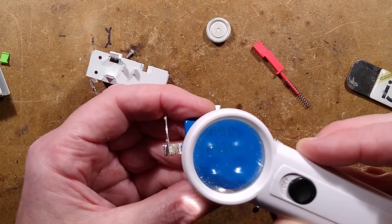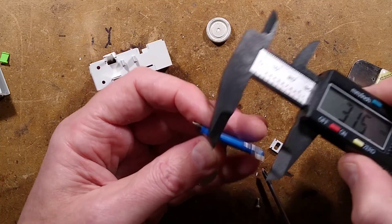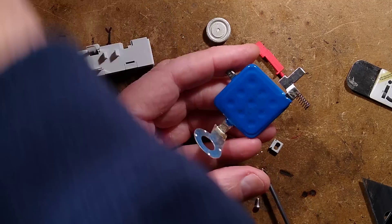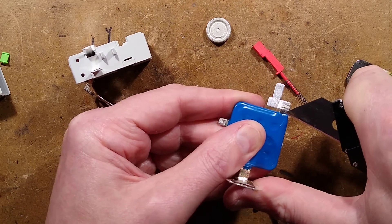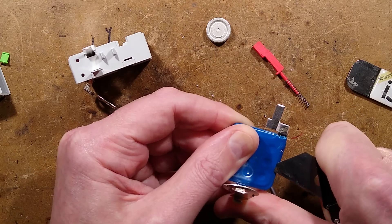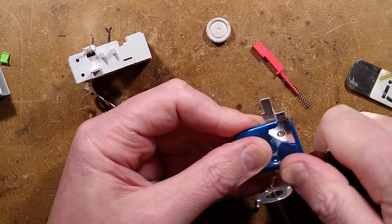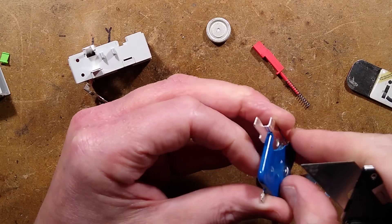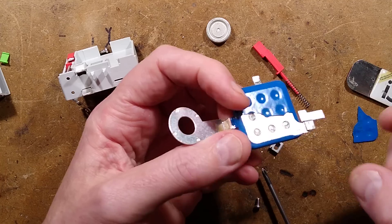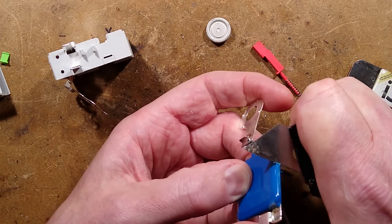4SK-34 - I'd normally expect that to be the size. So it's a 34mm square metal oxide varistor. It's got a plate that appears to be soldered onto either side. This plate is just soldered on - it's basically a square slab of the varistor material with a metal plate soldered onto the side. If you peel a bit of the end off you'd see the ceramic material inside. It's mated firmly onto the ceramic.